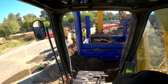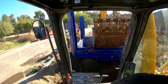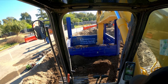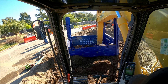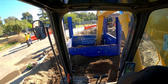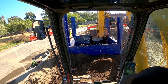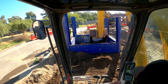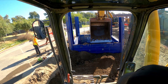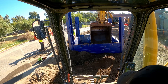An important part of digging into these shores is you don't want to undermine the one closest to yourself, because creating a hole behind these panels will create problems later on and even possible collapse of the material on the outside of the shore. As you're digging, you only want to go just a little bit deeper than the panel itself, then push the panel back into the ground creating a barrier preventing any material from sliding into the hole.